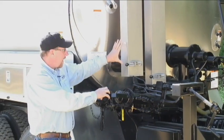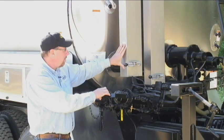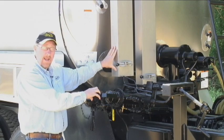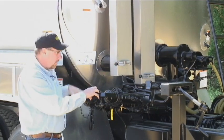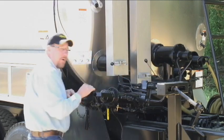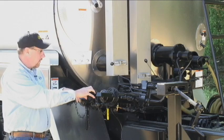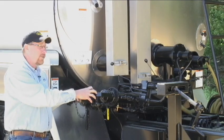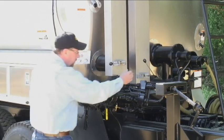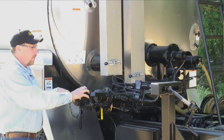I'd like to talk about the smokestacks, or the flue tubes as we call them, that go in relationship with the burners. Before the burners can be lit, we want to make sure that these dampers are open. It's very simple — lift the lever and pull it open. That will open the flue so when we light the burners they'll get good draft. Once you're done with your burner operation, make sure we close those so we don't create a draft through our tubes, and then lock them down into place.